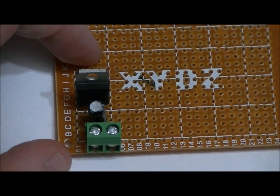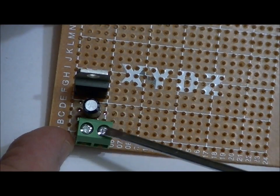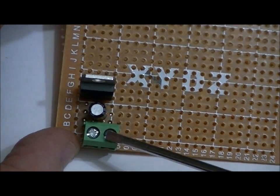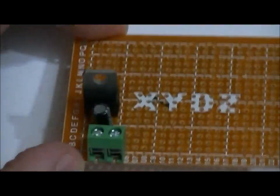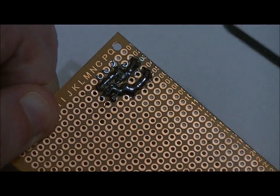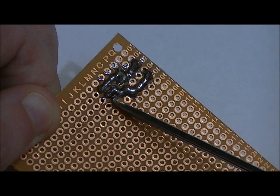Things can get a little complicated when you turn the board around as things are reversed. We've got our capacitor with the negative lead connected here and the positive lead connected to pin 1, and the ground line connected to the negative of the capacitor and pin 2. Pin 3 is left alone. I've been doing some solder bridging: input line and capacitor positive lead to pin 1, ground to pin 2, pin 3 left alone.